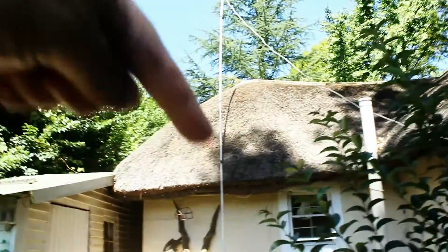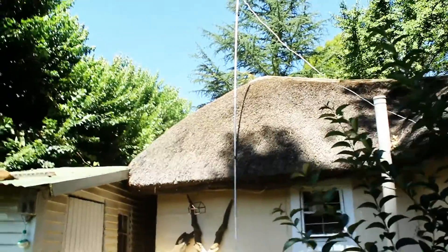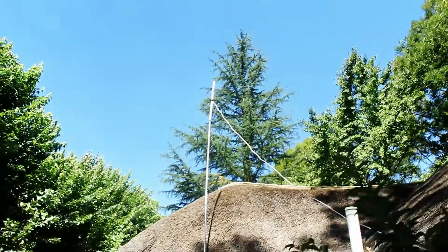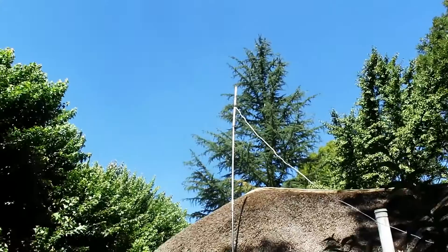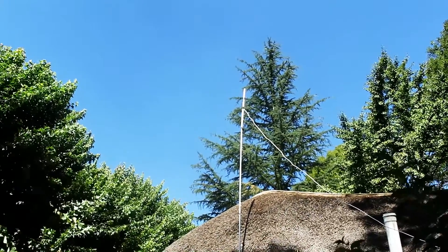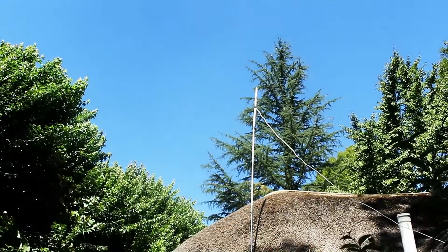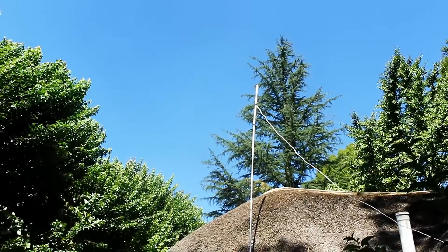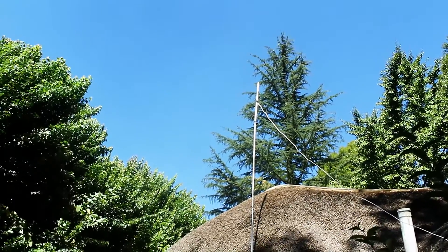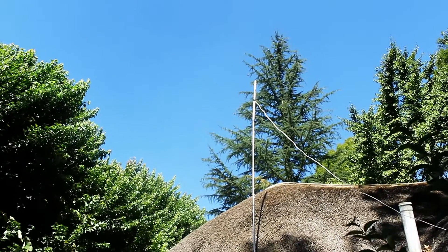And then behind the house, over there, there's a hill. So that's no good at all. There is another way, if you don't want to faff around making a folded dipole — there's another way to increase the range of the standard antenna that comes with DVB-T sticks. And that's to cut it down into a quarter wave. That's the easiest way to do it. We'll come back to that quarter wave later, because we'll need it for the next project. The next project's the one with a little bit more relevance for drone use.